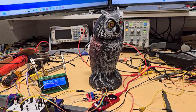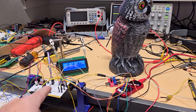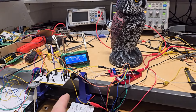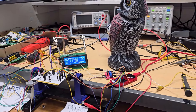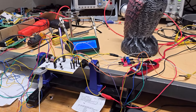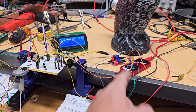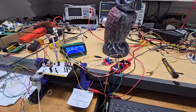Just dumped in the modified code - should be set. I did screw up - I started writing the code after I hooked that wire up, and then I didn't put the code in there, and when I hooked the wire up it started acting all sorts of crazy. The problem was I was still set as an input after I soldered on this connection and plugged it in. That had me thinking something was wrong with this MOSFET driver - just a little cheap Amazon one, but you can't even build them for these costs.